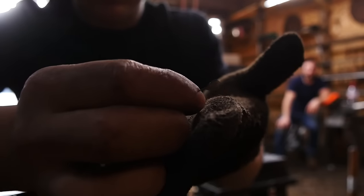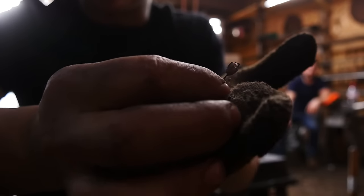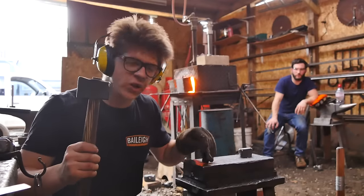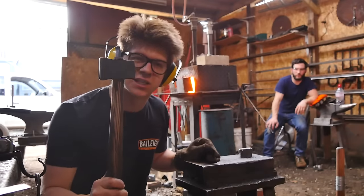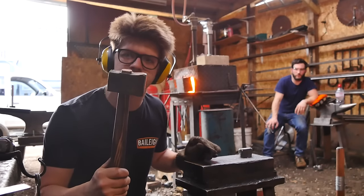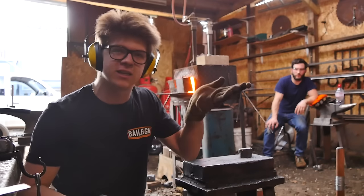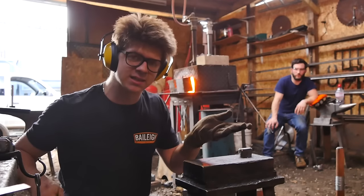And there was this small sliver of steel that was just barely attached to it. I just plucked it off after the mishit. This is a prime example of why I don't harden the striking anvils, because this is an unhardened tough steel. This is the EN24, which means unhardened, it only just saved this chip from flying off. And that's a relatively sizable chip with the mishit.